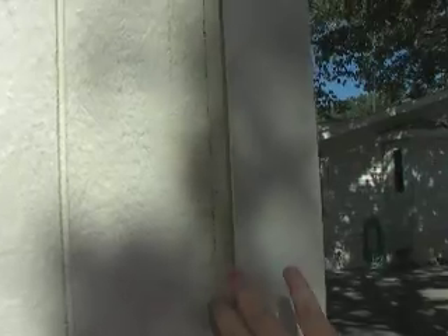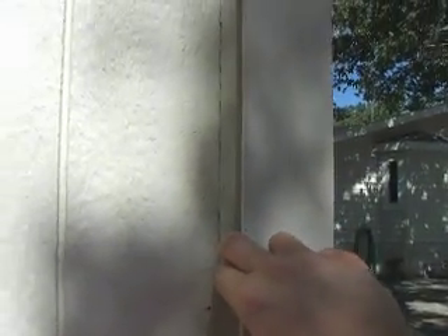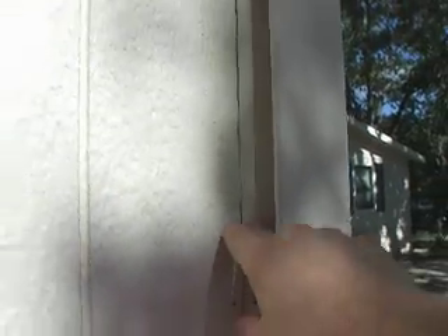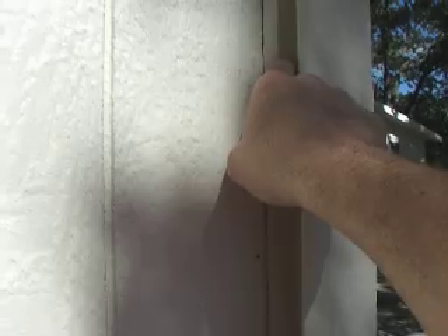What we're doing is we're going to do three sides of this garage — the two sides and the back. So over here at the side, let's leave this piece of trim on here, this coil stock, and start our Hardy here. If you want to put a three-quarter inch little one-by-two on this flashing and then butt the Hardy into that, that's fine.